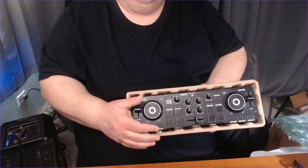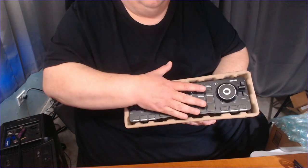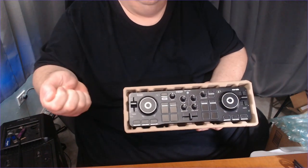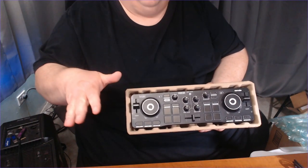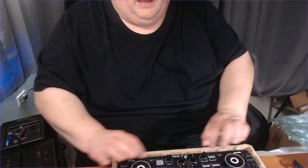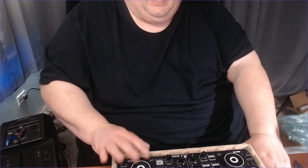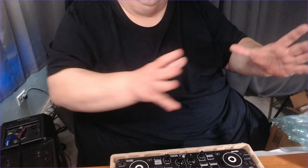If you plug this into, let's say, a Maui 5 Go like I have or one of the other battery-powered units, you could plug this in there, again, via headphone jack to XLR into the unit, and then you can have your microphones plugged into the unit as well, and then mix in, which is great. It doesn't have any other inputs other than USB, so you can't use it as your mixer for audio like I can, plugging in microphones and so forth. So if you're going to use this with microphones, you would need a separate mixer either on the speaker itself or a separate little one.